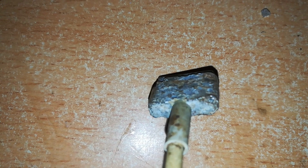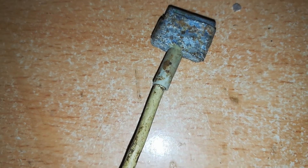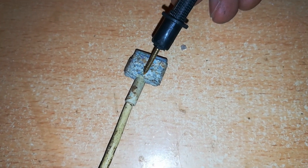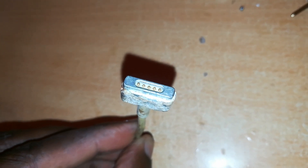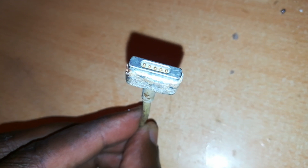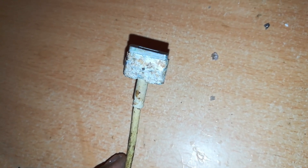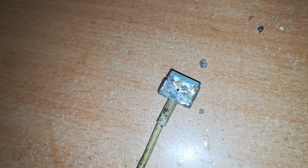On the underneath of this connector we have the spreading of the corrosion. I think this is an aluminum casing — the corrosion is still prevalent. As you can see, the rubber junction is almost being exposed because the corrosion has eaten away at that point in the casing. Let's look at the pins — surprise, surprise, the pins are still in good shape! These pins are what made me go on with the next part of this inquiry. I wanted to see if a connector can be this damaged and still work, and also educate you on how much this can go through and still function.